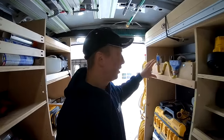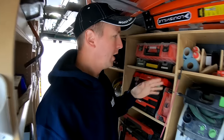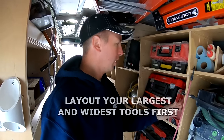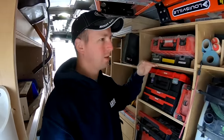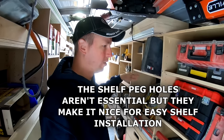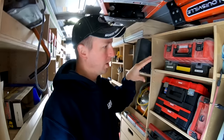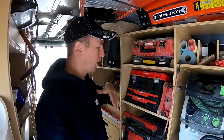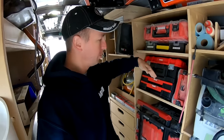As far as the construction method, you can see I've got verticals and horizontals. I laid out all my tools and started with verticals, then drilled shelf peg holes in all of them so the holes are at the same height. That keeps my shelves nice and level because I can just use pins to set the shelves and know I'm right where I need to be. If I want to incline a shelf — like I have here so my boxes don't fly off — I just drop the pins on the back side of the shelf, which puts some incline on it.